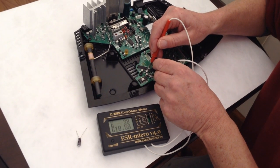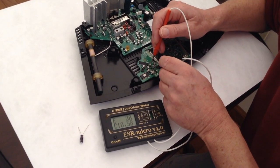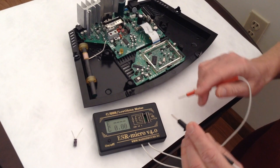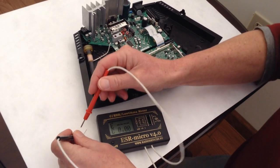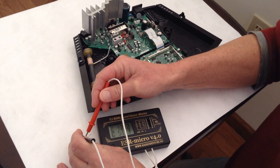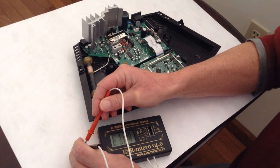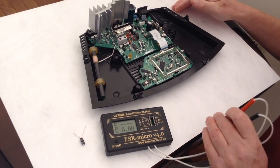This is a 10 microfarad capacitor, which is measuring 10, but has an ESR of 38, which is really, really high. Here's another 47 — it's measuring 44, but the ESR is 14. I'm going to be replacing most of these filter caps with a through-hole high-quality Panasonic low-ESR cap. This replacement cap measures about 51 with an ESR of 1.5.